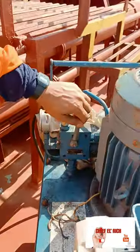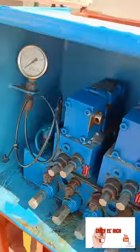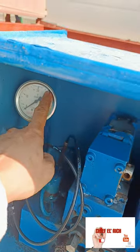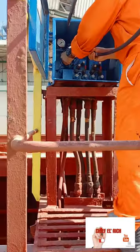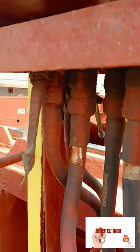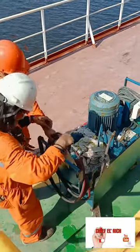Stop the pump power. Open the pressure release valve. Make sure that the pressure of the pump is zero, as well as at the control stand, before you remove the hydraulic hoses. Once the hoses are removed, open again the hydraulic valves. Secure the hydraulic hoses properly and avoid dropping them on the floor, as that might cause damage to the quick-connect coupling.